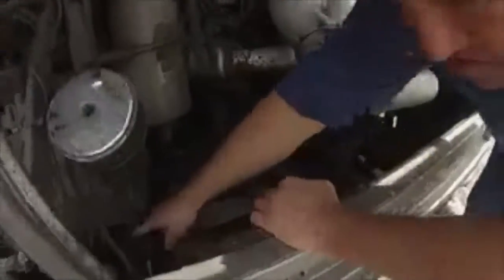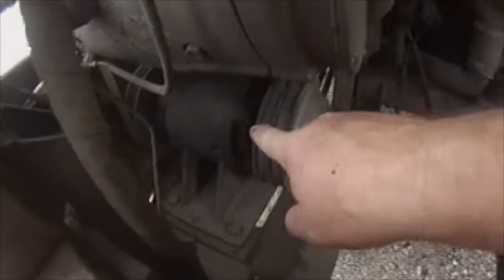It gets technical, but if you come around over here, there's the drive shaft that drives it. This is a pillow block that turns it — there's a grease fitting right back in here. There's another one right back in there. There are two bearings that have to be greased.